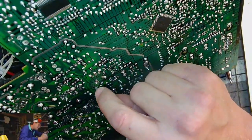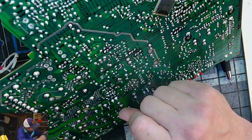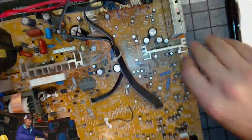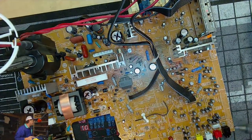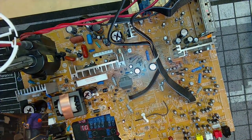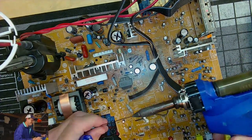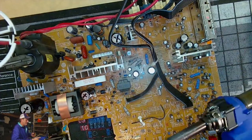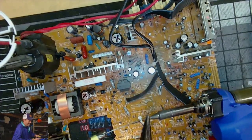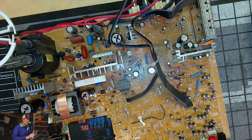I'm just inspecting it down there. Yeah, it's just crusty. It doesn't want to come off right. And there it is, a big old chunk of that unleaded mess. Well, I'm going to have to take a second and check out what this is doing to my FR301, because it sounds like it's clogging it up more than it should. In an attempt to pretend to make a CRT health conscious, right? By using lead-free solder. Yes, I think we broke through. I think so. Let's make sure.